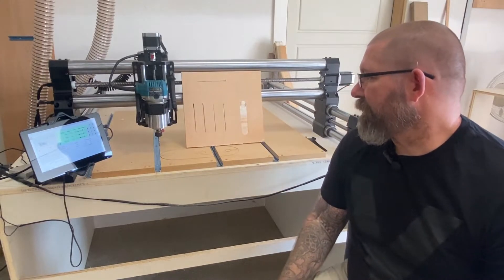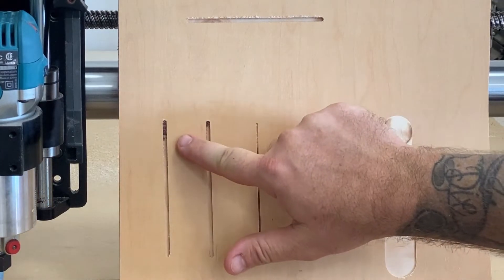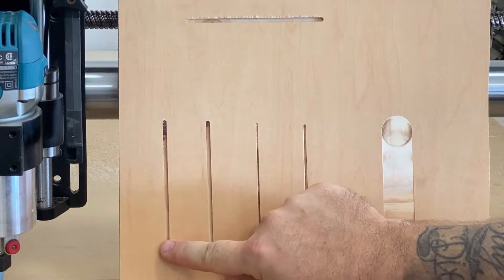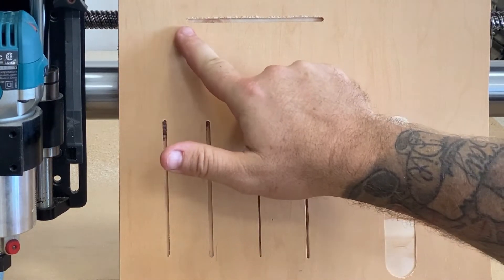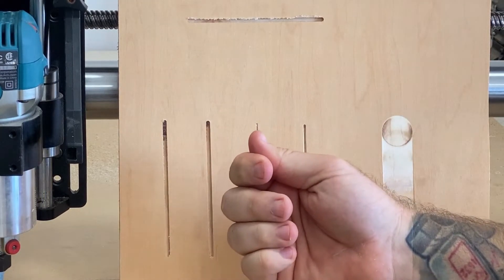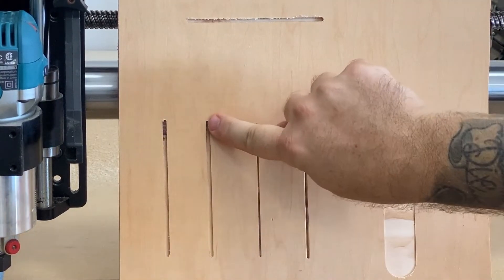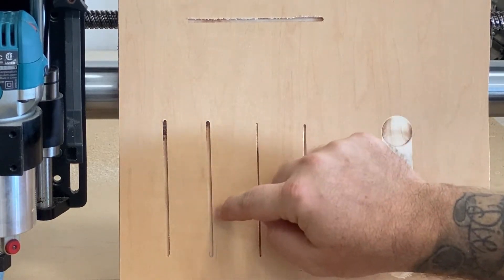So here we see the results of our test. You'll notice a couple of things here, in fact a couple of happy accidents that I had not anticipated. With the upcut bit, when we're running along the surface of the grain, you'll notice that the cut's actually pretty clean. When we get up to the top and bottom edges, that's when we saw the burrs. When we run across the grain, you'll see there's quite a few burrs and we would have to clean that up. That's because the upcut bit pulls the fibers up to try to remove them. The downcut bit pushes the fibers down, so you get a much smoother top surface, but you're going to get a rougher bottom surface.